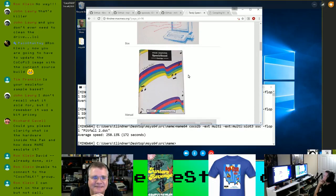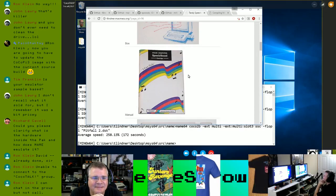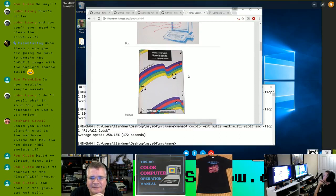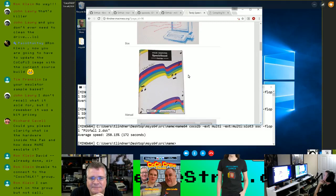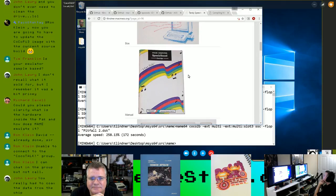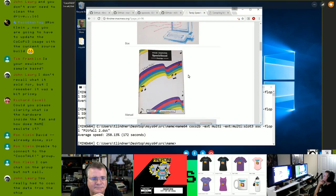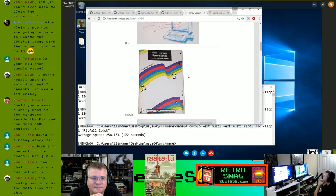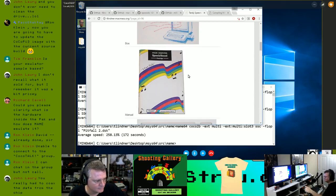We had to create a running program, and the data manual did not say what would happen if you tried to change this pin from microprocessor mode to microcontroller mode. It could conceivably have reset itself, and then cleared out all the RAM, and our program would have been gone, and it would have done its normal boot up. But fortunately, it didn't. It just continued on as if nothing was happening, except we could see the ROM now. Impressive. And I'd like to thank Frank Palazzolo for that work. He is a very experienced hardware engineer.